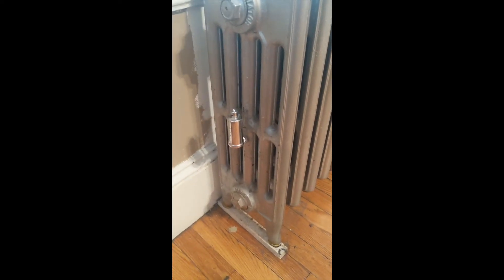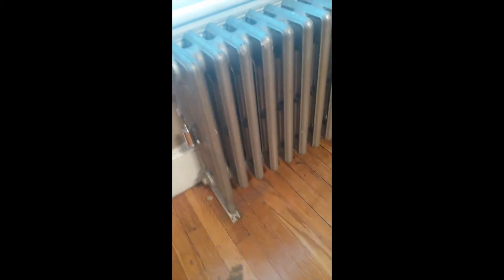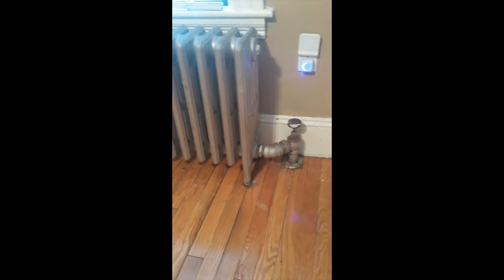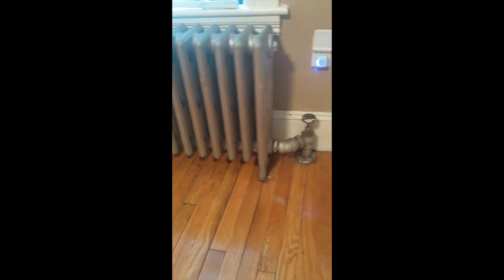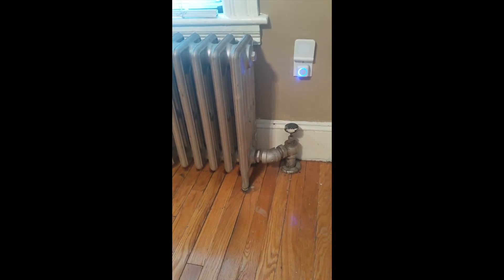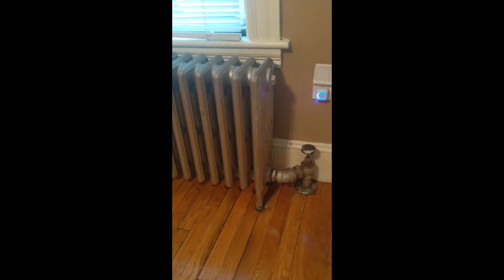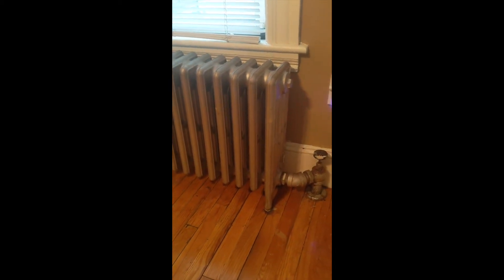So if you have radiators that have no heat at all, that's a good place to start. Also, down here you can see that I raised the opposite end of the radiator from where the steam pipe is. This is a single pipe unit — not a two-pipe, not a closed unit. It's tilted towards the pipe so that the water can run back down there. So you have both the steam and the water in that same pipe — the water's going down, the steam's coming up, and that's what's causing the water hammer issue, because the steam is coming up at 60 to 70 miles an hour and the water is trying to go down and can't drain. That's that banging you're hearing.